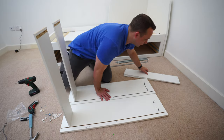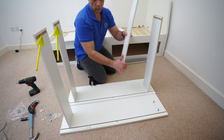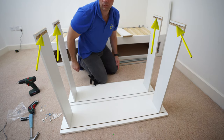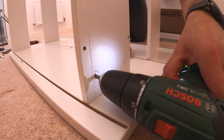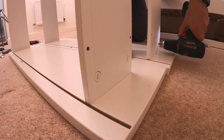Exactly the same on the other side — the gap is going to be on the inner side. That's where the back panel of the drawer is going to go above. Place it in; if you positioned the locks in the right position you're going to be okay. You can see all four gaps on the inner side. Just twist the locks to the right side — an electric screwdriver with an adjustable clutch is helpful here.